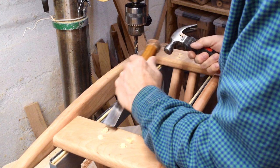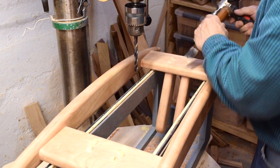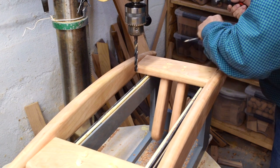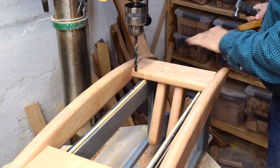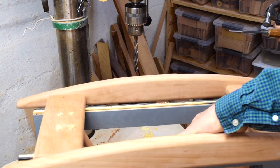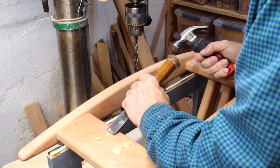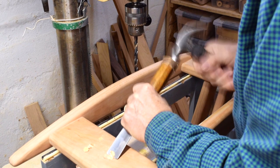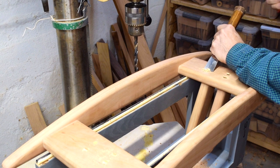This is that shallow sweep gouge I'm using to pare off the dowels. I go about 3/4 of the way from one direction, then rotate and hit the other quarter from the opposite side. Makes a nice clean cut. And sometimes a drill press serves as a workbench. These dowel ends could be sanded off with a random orbit hand sander, or just elbow grease and a regular hand sander if you don't want to use the gouge.